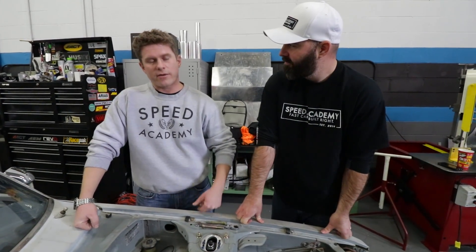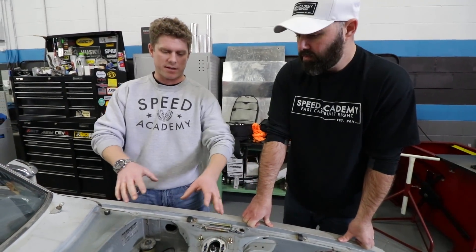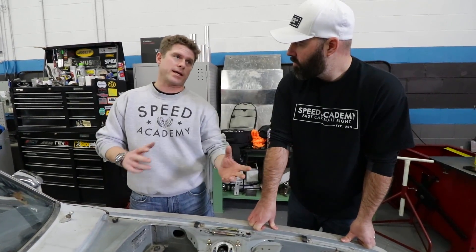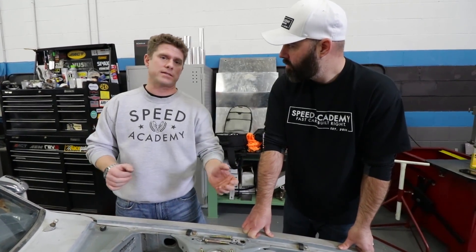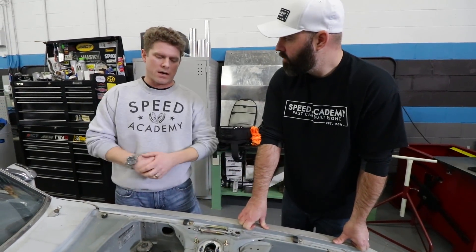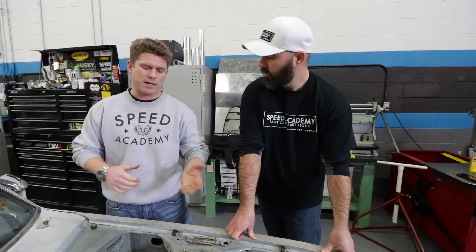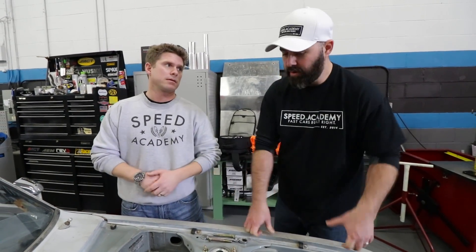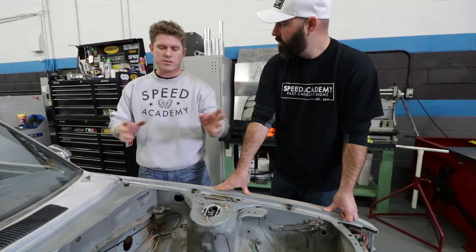After mocking things up, Jay will use a scanner. Vibrant has an Artec Eva scanner that captures shapes and surfaces and translates them into the computer, so he can pick them up in SolidWorks and design the header from scratch. This allows him to build a jig for reproduction, ensure accurate placement, and if someone else needs to build a replacement header they can work from the same file. It also allows him to accurately gauge runner lengths and placement on a jig table without wasting materials.